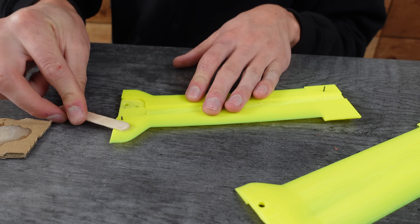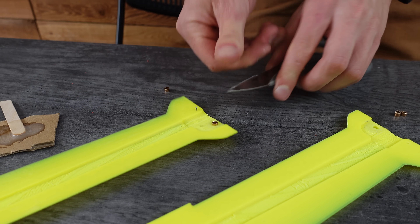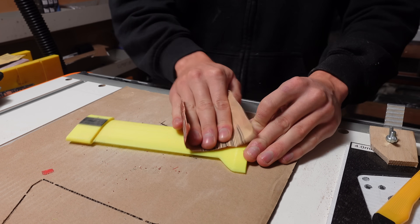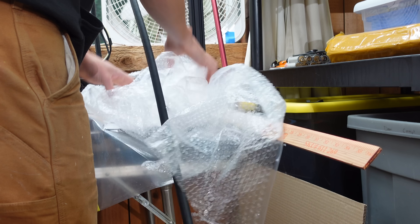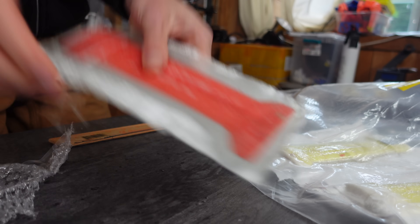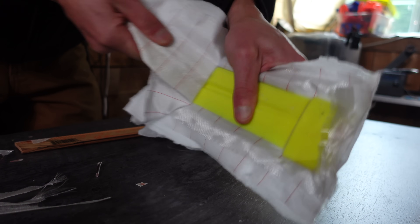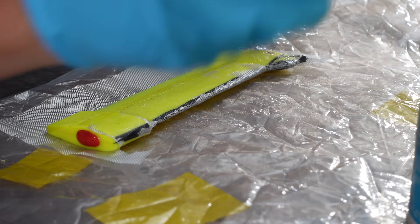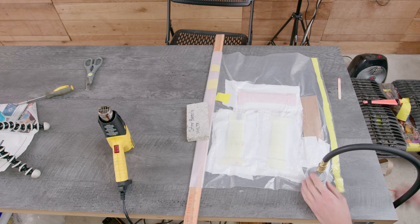Next it was time to build the vertical parts. These are made from two 3D printed halves that I glued together. There are some little steel pins for alignment, and here I'm pressing in the bronze bushings for the pivot mechanism. Once the glue dried, I sanded those down smooth and then plugged the holes with clay. Next was more epoxy and fiberglass — I got all the layers together, added some peel ply, put it in the vacuum bag, and back on the 3D printer bed. And that's when tragedy struck. I only had the temperature like 5 degrees C hotter than before, but the PLA melted. I really never learned my lesson when it comes to melting 3D printed molds. When I peeled off the peel ply, it would create triboluminescent x-rays, which is pretty cool. So after irradiating myself, I had to do the whole thing over again. This time I had some spare carbon tow, so I put it on the leading edge — that's what the black stripe is. After doing the whole thing over again, I finally had some usable parts.